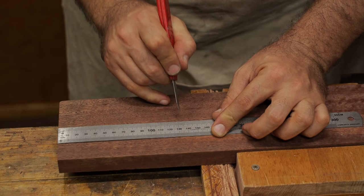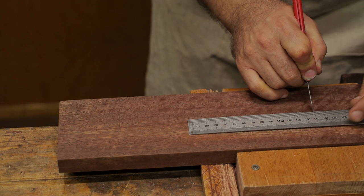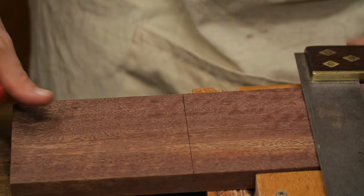So I'm going to make that mark, come back up against that knife here, make the second mark here, and then obviously we'll jump over and do the third mark. Come back with the square, as we usually would. Light pass, heavier pass, heavier pass. It's a very heavy and defined line. That's what we want. Then obviously off our reference face, which is this front one,